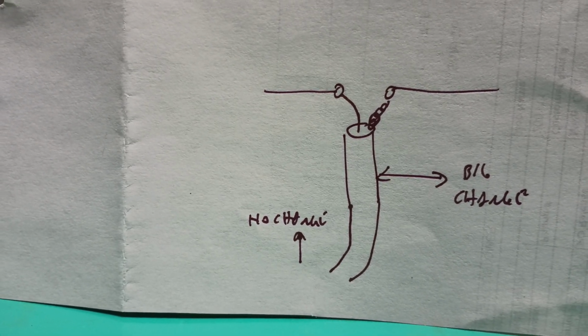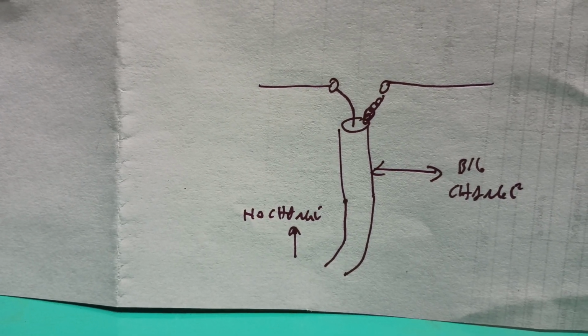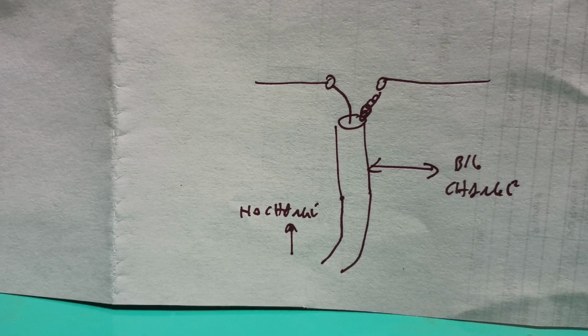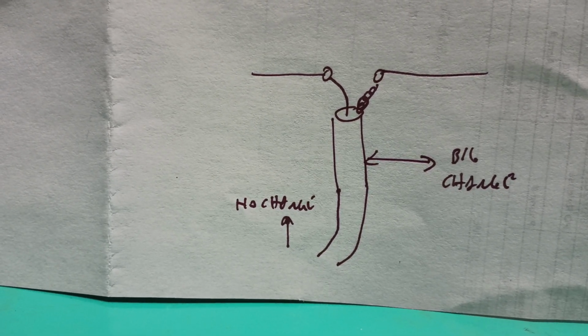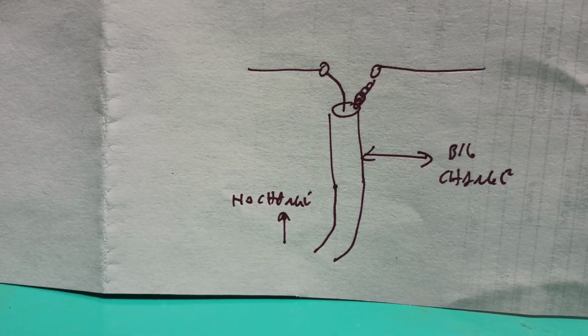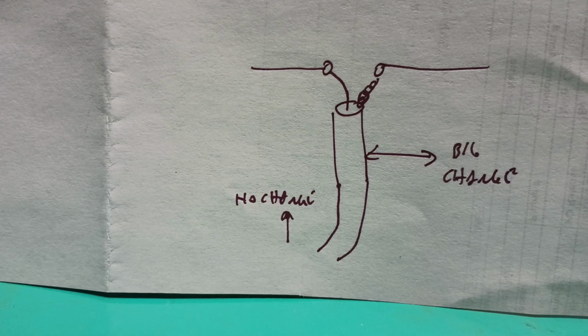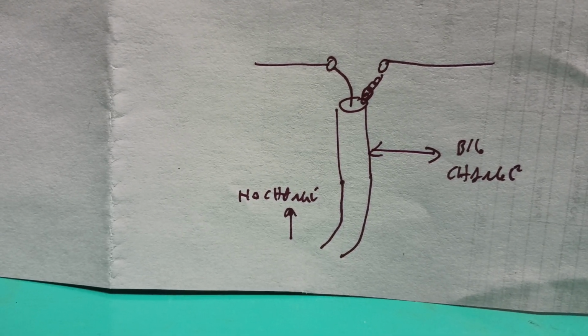And this takes us to this idea of this nonsense of putting ferrite clamps to stop current from going down the outside of the shield. Firstly, there's no such thing as outside of the shield. It's little round wires, they're conductors. There's no inside, there's no outside. Inside and outside are only mechanical. And with regard to the fields, not the current.